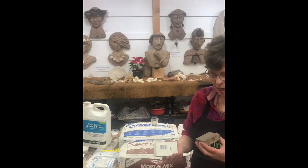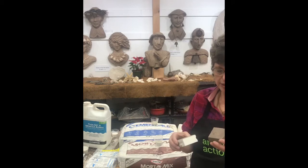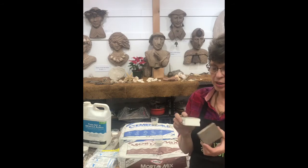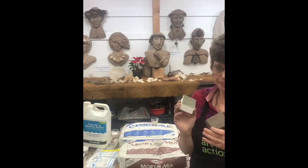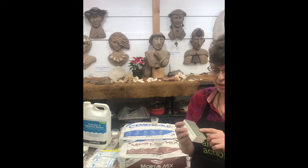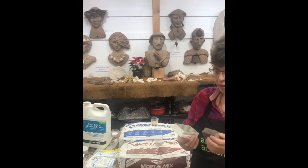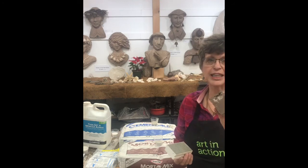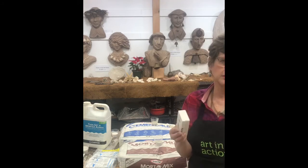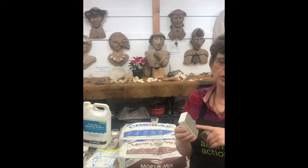And then I sand my pieces when they're 3/4 cured to get the residue off the edges. I use these sanding sponges that are used on sheetrock. From the Concrete Countertop Supply, I bought one of these pads, and this is like plastic. It's amazing, and it does grind the concrete. It was $19.95 for this little square, but this is what happens quickly to the foam ones. So it'll last me for a couple different pieces, and I can get the foam ones locally as well. But it's always fun to try new products.